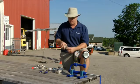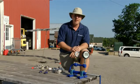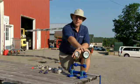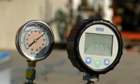Some testing methods are within a grower's reach, some aren't. We've got this model from Belgium — very expensive, from AAMS — and it's used with hydraulics. We know that this gauge has been calibrated and is accurate. This is the gauge we want to test. It gets plugged in, we crank it up, and if they match, then our gauge is accurate.